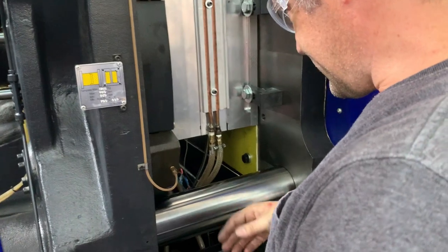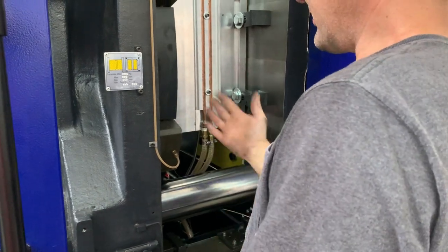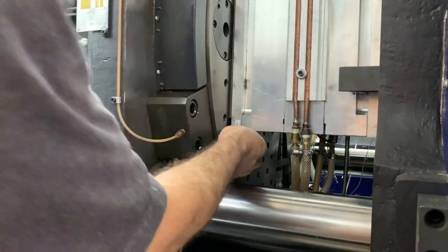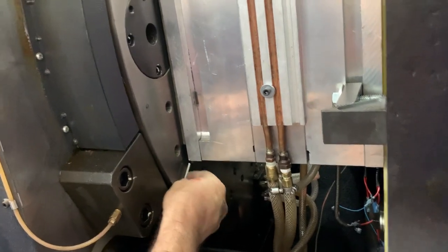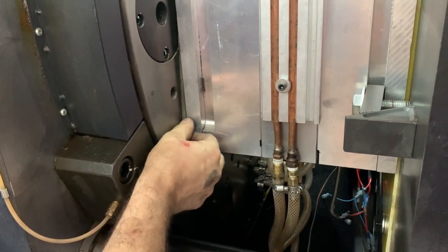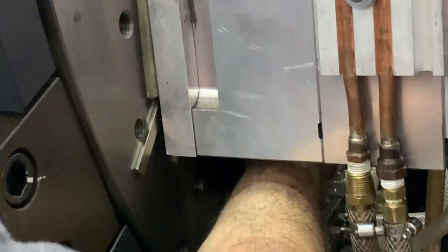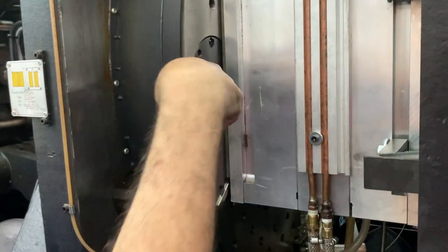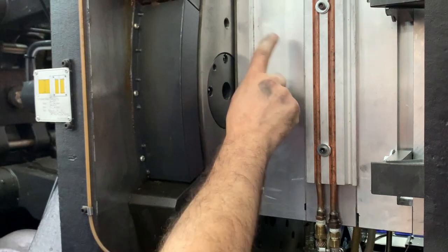Yeah, so somehow I need to. I've got magnets. Maybe I'll hold this second heat isolator up with magnets, and then we can close it and then clamp it down. These heat isolators are from the 90-ton, the Chewbacca machine. But these magnets will hold it up temporarily. I'm gonna stick this other one on the other side. And the magnets are skinnier than the spacer, so we should be okay. Yeah, there they are. Okay. Because we don't want the center hole of this heat isolator to rub against the ejector rod, which is pushing in and out on the ejector plate of this mold.